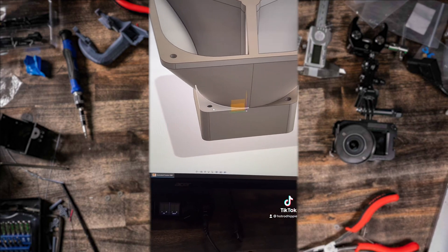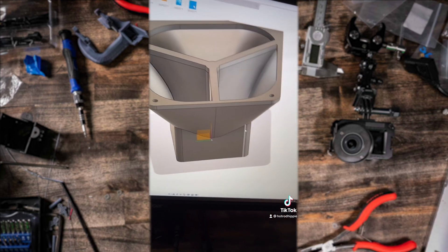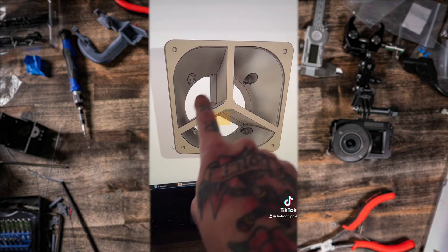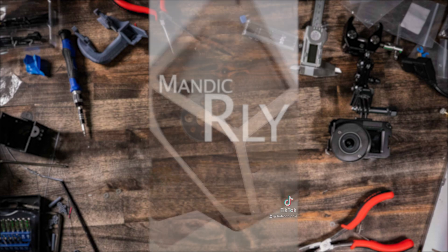This weird flange thing here I can delete just by selecting it and hitting delete — repeat that and it'll continue with the geometry. I used the bolt pattern and some negative extrusions to create the bolt pattern for bolting this onto the laser body. Then I finish it off with some minor detail work, such as rounding off corners, and then we'll slice the design.